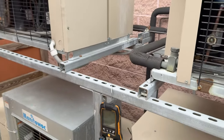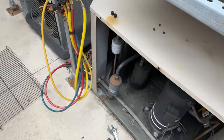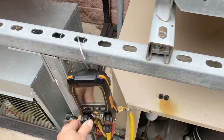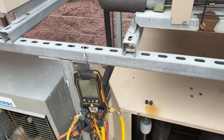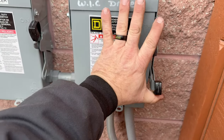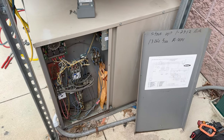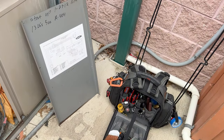We're going to come over here and valve that off, which we've already done. Let's kick it on - I've got my manifold shut. That didn't like that very well, but it'll get over it. We're going to let this thing pump down and get all that liquid refrigerant out of there. Can't leave it open because it might go through the compressor. Keep in mind it's valved off so it's not going anywhere, but we are now sending power into that solenoid so we can relieve the pressure on the other side of the solenoid.